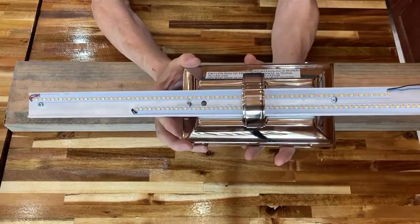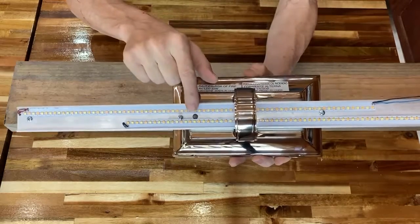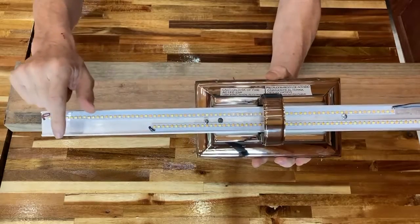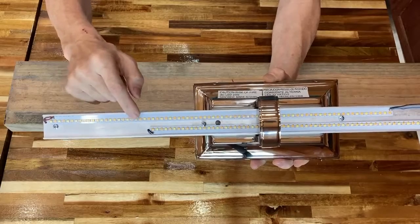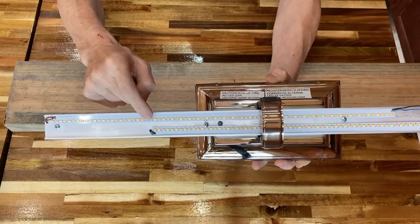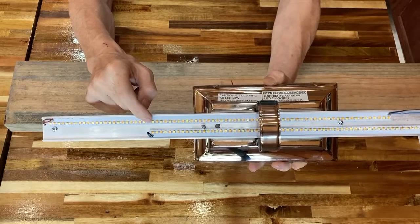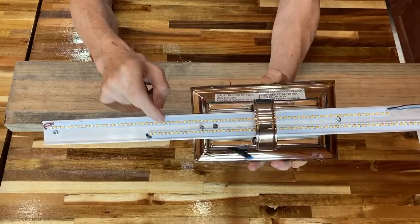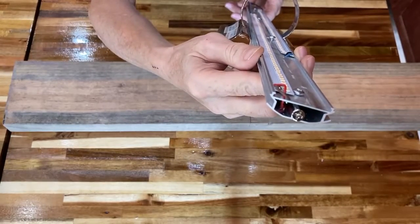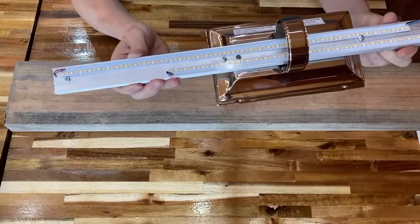I've taken a moment to do some drilling of the various holes off camera. I drilled a hole here to feed the wires in and embedded the wires into the aluminum chase underneath so that there'd be no shadows. The LED strips are now attached — these are tunable white strips, meaning alternating LEDs are different color temperatures. The warm temperature is 2,700 degrees Kelvin and the cool temperature is 5,000 degrees Kelvin. These are provided by ATX LED and are now mounted into the channel. You can see them going down here, and we've hidden the wires so there'll be no shadows when we put on the cover.